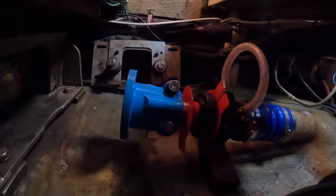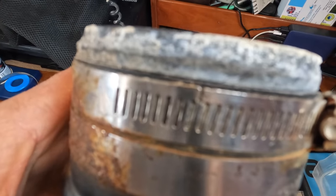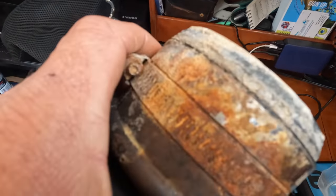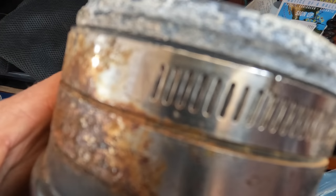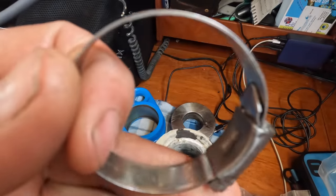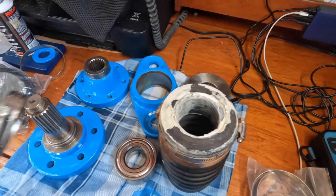Captain Lee's tip for today: have a look at this — there's a crack right there in that hose clamp, and I have had these fail before. Water sitting underneath causes that failure. That is so common on this design of clip. The ones I like to use are stamped — they don't go right through. I haven't had one of these fail, and they don't have that little section that breaks. They're pressed, and they are the ones I would recommend. They are a little bit dearer but worth every penny when it comes to keeping the ocean out of your boat.